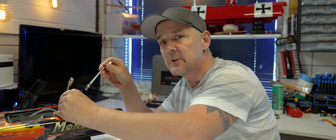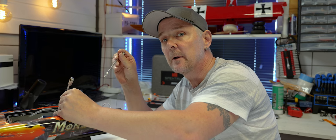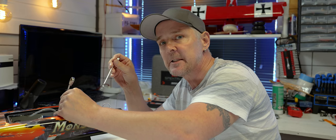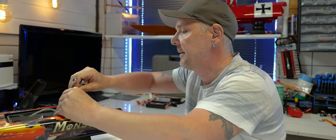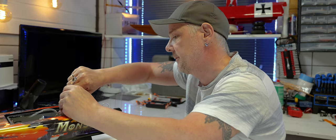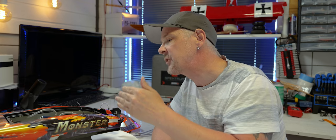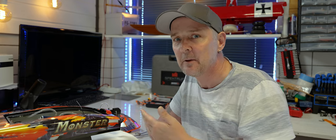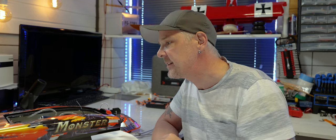And a good indication of this lock nut sort of being loose is when you are losing speed on your boat. Then you should get it in as fast as possible and tighten these. Just forgot what I called them. You want to unscrew every screw that is connecting to metal. Use Loctite on them. Make sure that they are nice and tight.